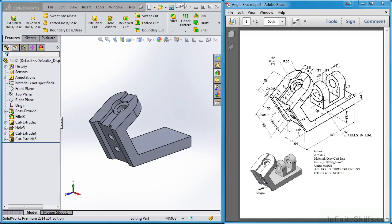That means it's centered. But how deep is this feature? Well, notice these radiuses are tangent. The radius is 19, so that makes this feature 38. Next, I want you to notice that we have a dimension of 19. Now that does include the 3mm boss. So the thickness from here to here is only 16. The same is true for this side.